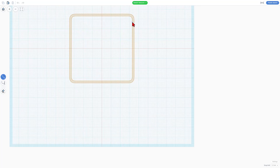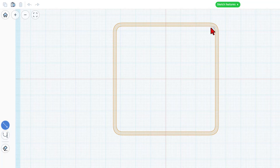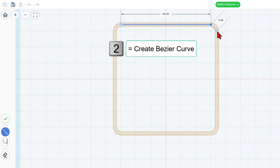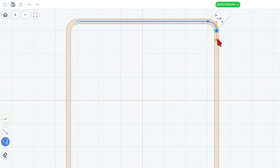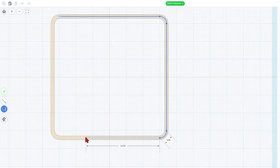With those basics out of the way, let me show you how to draw this super slick. The lines that matter are these corners right here. I'm going to start in the center of our 2mm wall and click, going right to the other edge — straight line. I'll press number 2 to do a bezier curve, and I want to be in the middle. Click, hold, and twist with that straight line until it matches just the way I want, then repeat the process all the way around. That 566 becomes a check mark so you know you're doing it right.